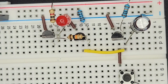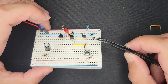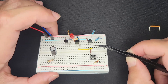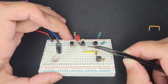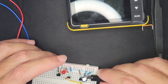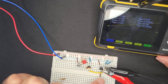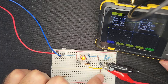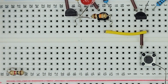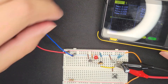Let's plug this in and see what happens. By default it leaves the LED off, then it turns on — so I think this is in reverse. By default the capacitor is going to be charged because this base is not activated. The current from this resistor is forced to go through the capacitor and charge up, which will turn on this base and turn on the LED. So we need to invert our button's input. Let's connect the oscilloscope to really see what's going on. We can see the capacitor charging. Once it reaches the value that turns on the base, we can see it turns on. I'm going to press the button now — and nothing is really happening. The button is not connected to any power. Let me plug in power, and let's try this again.